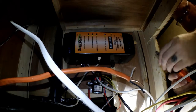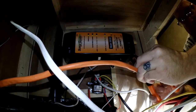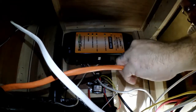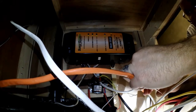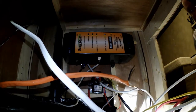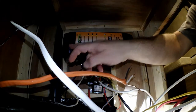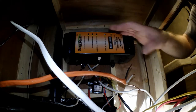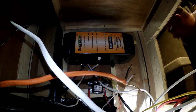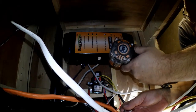Okay, so we've got 10-gauge wire. It says to strip roughly a half inch, so there's a half inch on the white and about a half inch on the black. Our supply line is disconnected and cut loose, and it's ready to be installed into the circuit. I'm going to take the screws out and pull the unit out where I can lay it down and hook it up — I'm at a really awkward angle back here.